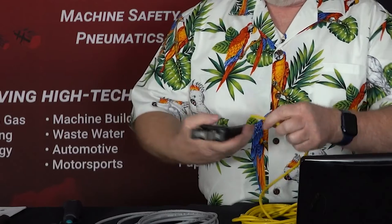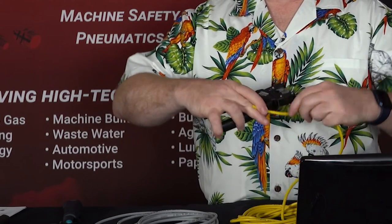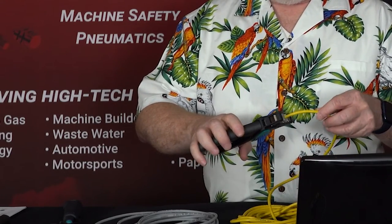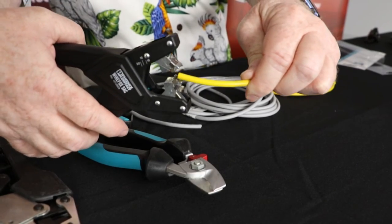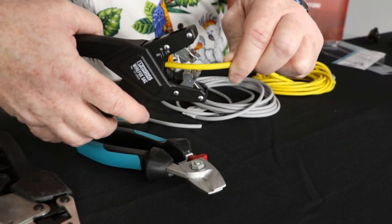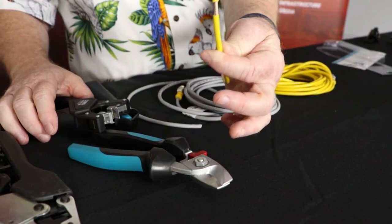If I slide this out of the package, I end up with a simple tool that's marked for wire strip depth. It's pretty simple to operate — I just line up my cable, shove it down the throat of the tool, and if I want a longer strip I can push it all the way down to center. It's a pass-through, then I crimp on the wire. Coming in close: bring it in, grab it, snip, pull it back, and it leaves the jacket stripped just like that.